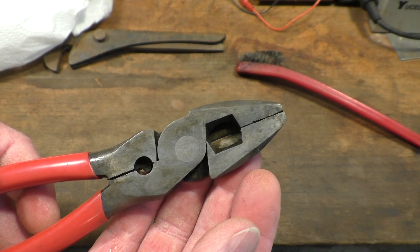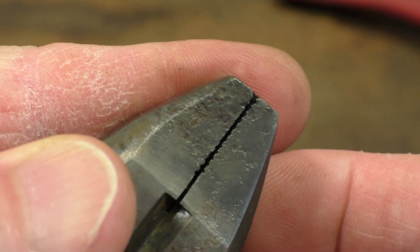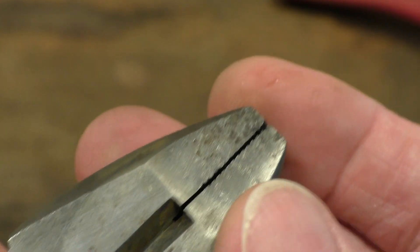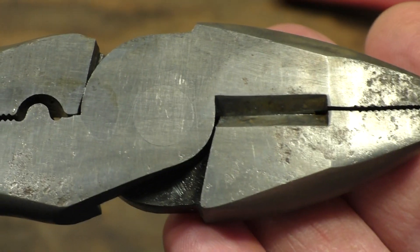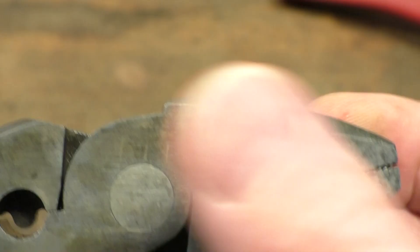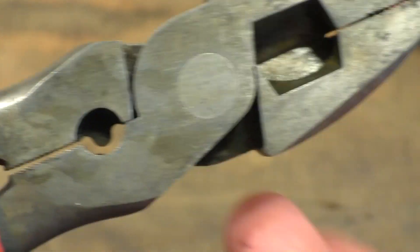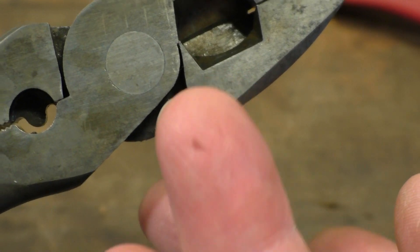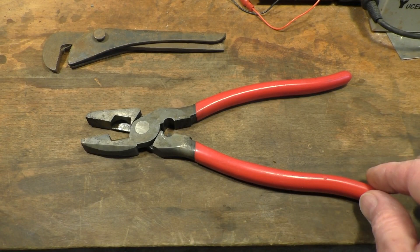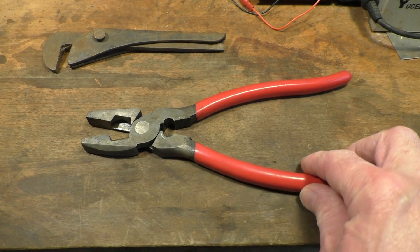So it's been a few hours — two or three hours. I've been out here every now and again giving these a little gentle wire brushing over, and some of the rust is actually coming off quite nicely. There's only a few little bits on here, not a great deal left. So let's just get them dried down a bit, move the vinegar off, and have a bit of a look at them. They're a little bit damp with the vinegar. As we can see, they've gone a little black.